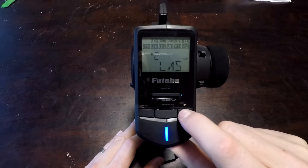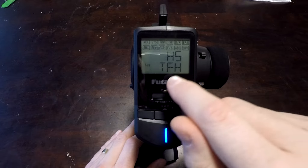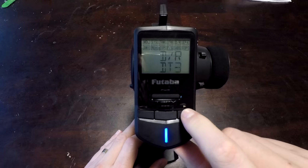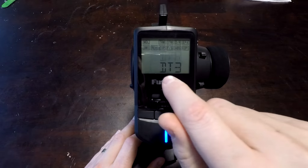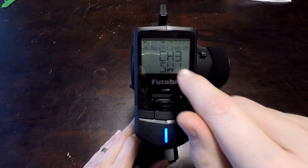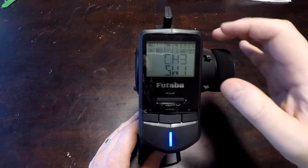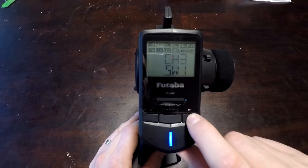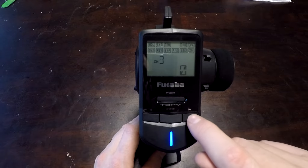In the next button we can go through the name. We can set up our low voltage alarm. Now we're over to system — this is the aforementioned S versus T FHSS protocols. Link is to link a new receiver to the radio. Now we're looking at where the dual rate control is. In this case, the DT3 is the little guy up front. Channel 3 is controlled from switch 1, which is right here on the side, but I can switch those around. Now we're on to the trim settings, then the sub-trim settings — we can do that for channels 1, 2, and 3.